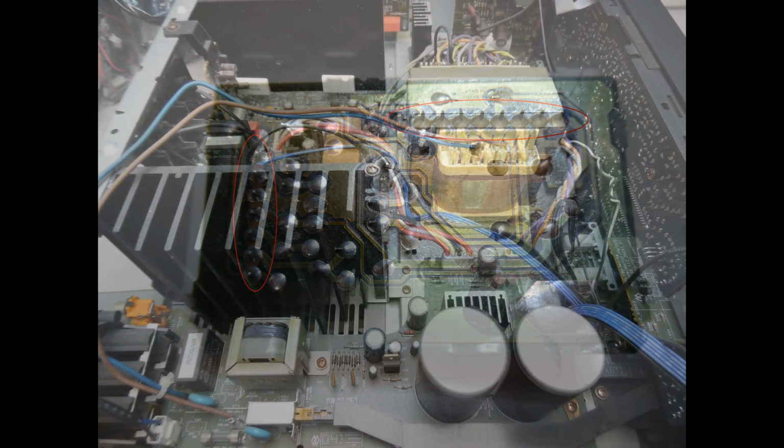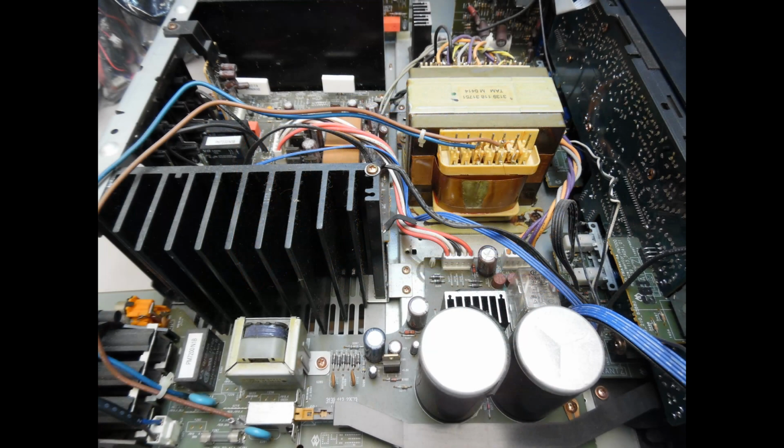And then here we take an aerial shot, and the board which is closest to us, that is the large power supply, and what you can see is there's a smaller EI transformer, and that is used for the startup. There's also a power relay as well, which is driven of course from the microcontroller, and then you have two large canisters as they look, and these are the electrolytic smoothing capacitors. And there is also a smaller lower voltage power supply on there, and you also have a relay. We'll speak about the relay in a moment.